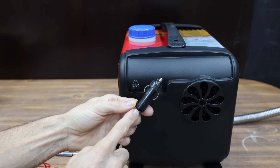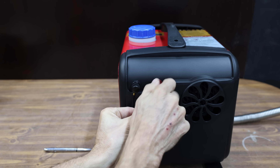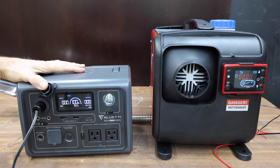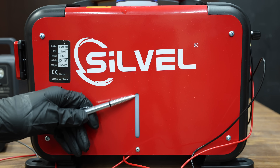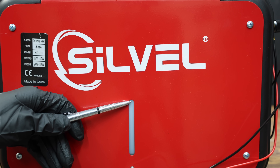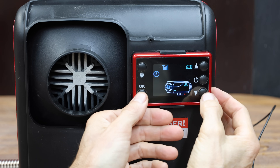The diesel heater requires a 12-volt power source. I have an extra 12-volt cigarette lighter adapter and a power analyzer to keep track of the 12-volt energy use. Let's see how this solar power station performs as our 12-volt power source. Let's go ahead and add a half gallon of diesel fuel. There is a fuel window on the side of the machine, and we just added a half gallon — the fuel tank should have at least a one-gallon capacity. The instructions are just not very easy to understand.